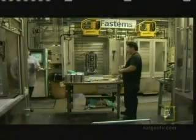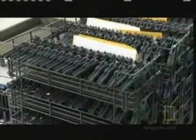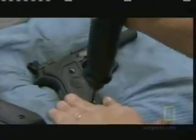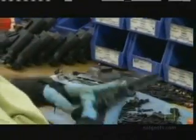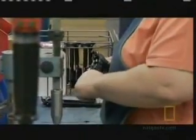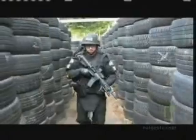After the prototype passes initial testing, they'll manufacture about 1,000 pre-series guns. From that group, we'll pull 100 of those and go through all the test firing and also do reliability and durability testing on the system. And it's important to do it in both cases, the first one to make sure the design is correct, and the second one to make sure that the manufacturing process that we've set up and that we're going to deliver into the field is working correctly.